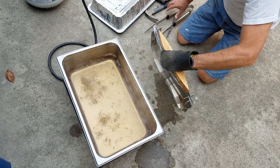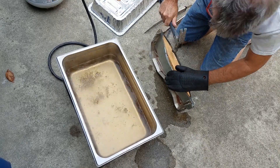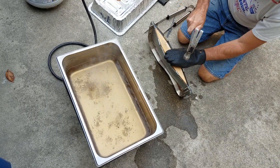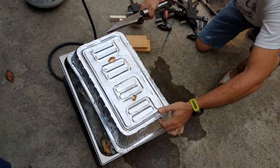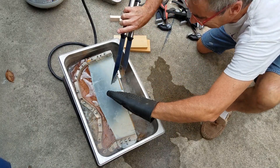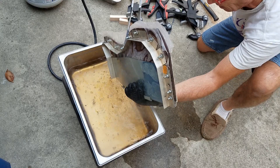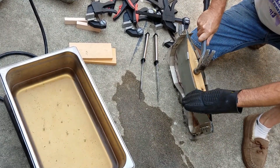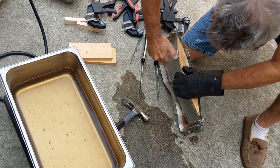Another five minutes, and again I'm gently tapping the former down. This time it slides all the way in. Back in the water for another five minute heating cycle to help it settle into shape, and then it's about done. Turn off the gas, and one last push into place. Now, out with the slippers — you don't want to leave those in, otherwise they might distort the wood as it dries.